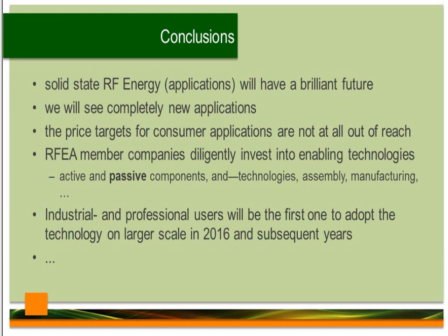Okay, and next question, maybe Klaus would be the best one to handle this. Does GaN have a future in solid-state microwave oven? I think we do have planned a future webinar discussing the actual power amplifier technologies themselves. That's true. I mean, there will be one or two at least. Well, the very brief answer is it depends. If you need the high performance, ruggedness, very high efficiency, broadbandedness for a microwave oven that you need to build, then you should look at gallium nitride.